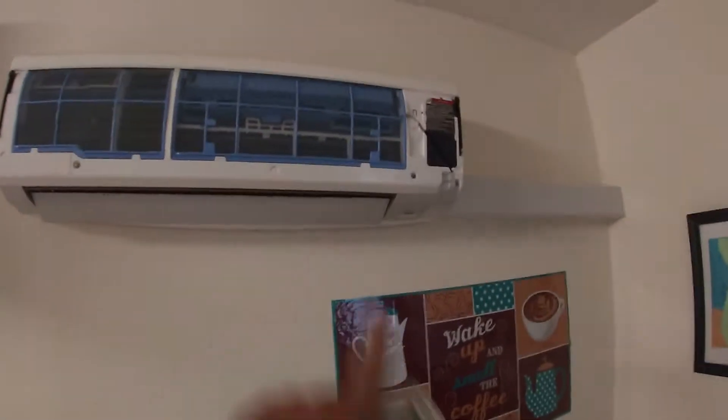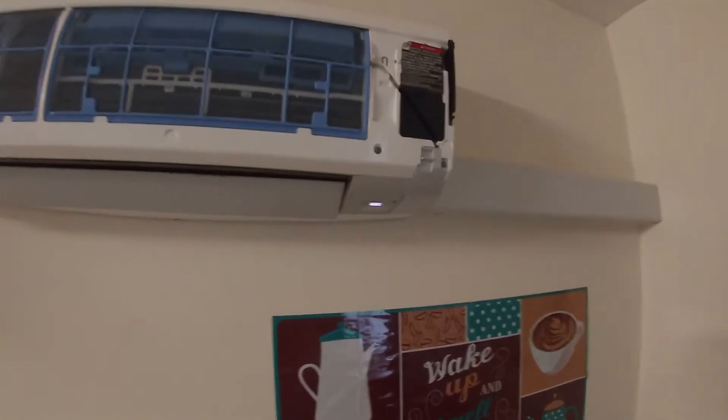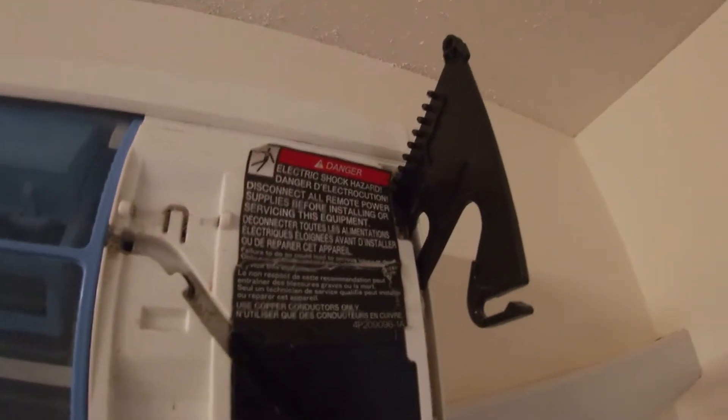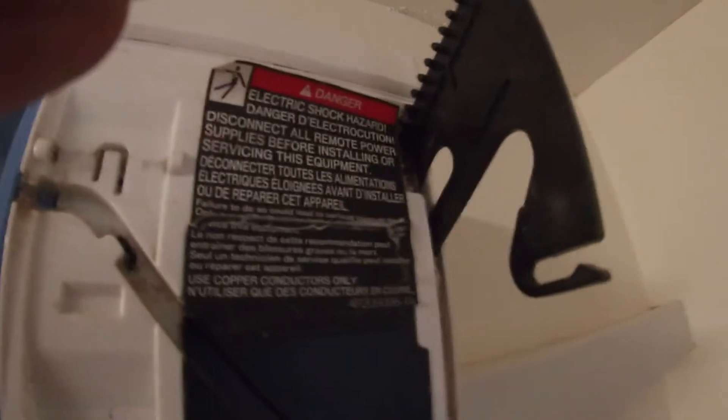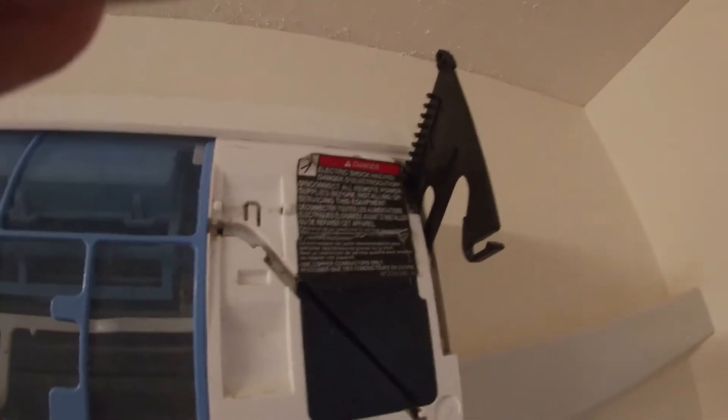What's up YouTube, so I've made some videos at this location before. We got a Daikin — you can see I took the door off, we got this track here. I'm gonna change that reducer assembly. We're gonna pull and clean this wheel. When that door would be on, the track is coming up and you're gonna hear the gears. There's a reducer assembly in there — it comes all the way out. You hear the gears? The weight of the door makes those gears strip out and then it shuts down, so you can see it never even tried to open up.